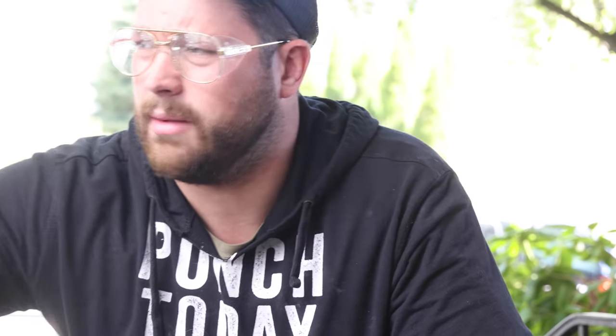To try to save this and make it a little bit smoother on top, we're going to pour what is called a skim coat. We're mixing some fortifier with water, getting it to a peanut-butter consistency, and skimming it over the top. I hope I don't screw it up.